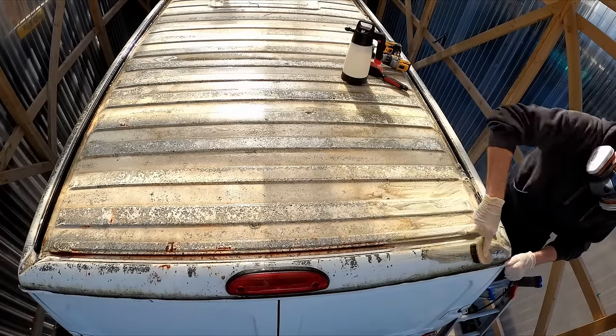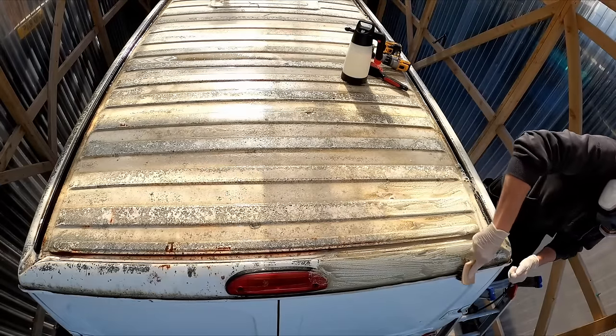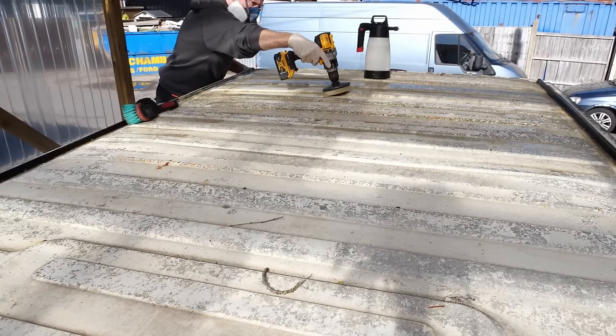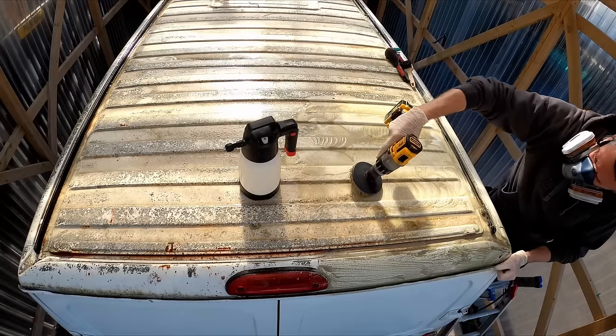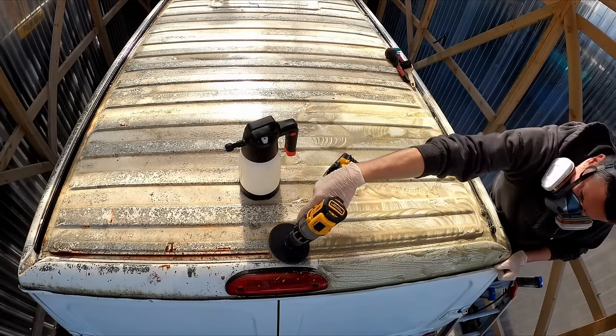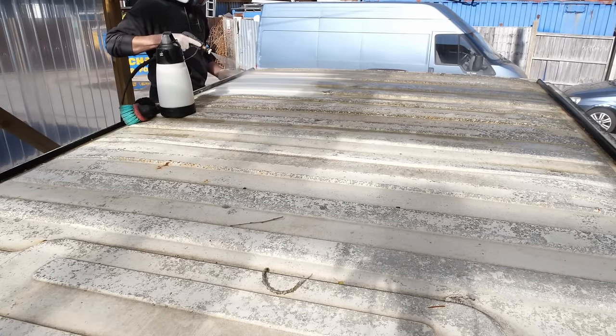After that I'm going to use a soft bristle brush just to go around the edges because it's got a rubber weather seal around there. There's also a rain guard or gully around the top of the panels which was full of moss, so I want to try and loosen that up. Then I'm going to be using a drill brush — which is going to upset a few people — but it's the only real thing that's going to remove years of grime and lichen off this roof quickly and effectively.